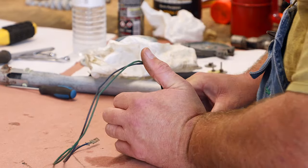So if the antenna is going up and it's not all the way up and this starts clicking, turn the big nut tighter. And basically, you just don't want to go too tight. You just want to have enough tension on this clutch that the mast can be moved up and down. Add a little bit more tension to it to make up for as it ages or it gets dirty. And call it good. And I'm calling this one good. I've done them per the service manual, and they don't always work on a worn unit. So that's why I'm giving the advice that I'm giving.